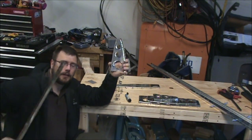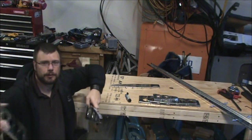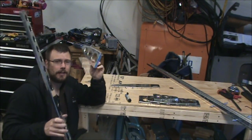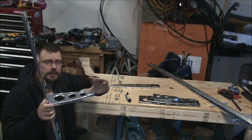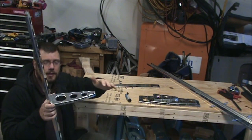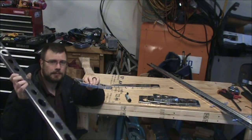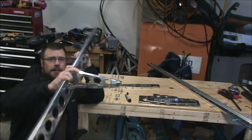They basically go out and support all the structure, but they take all the forces and then transfer that into that spar. And wings are made the same way. They usually have a main spar. Some wings might have two spars, but they'll run out from the fuselage out to the wingtip. And then the ribs will come off that, and you'll have like a nose rib, maybe a center rib, and maybe like a trailing edge rib.